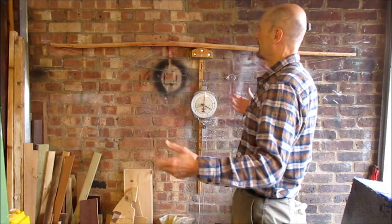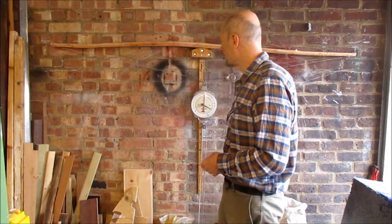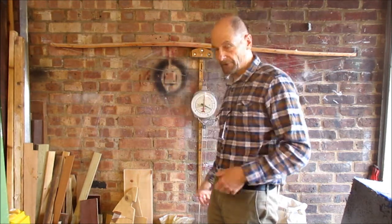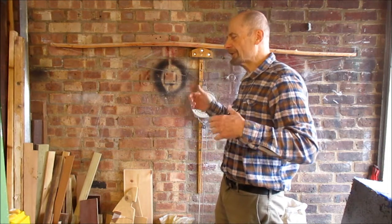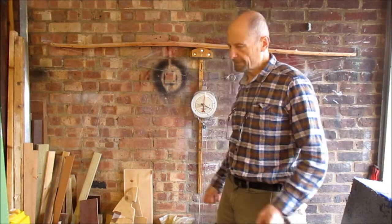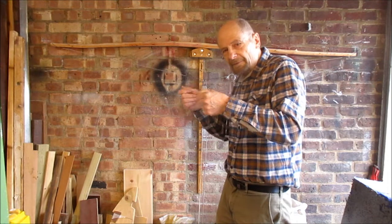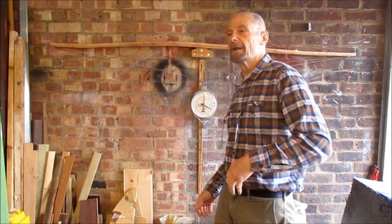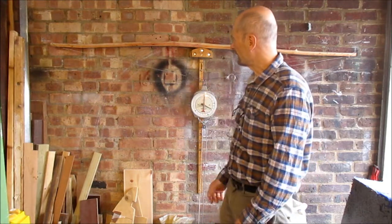So yeah, it's a heavy bow at the moment. I've got quite a lot of wood to take off. Some of those bits I was worried about will end up disappearing as I remove wood. And I now have an idea how much I can dig in with the draw knife on the shave horse. There's no point fiddling, doing little scrapes here and there and fettling. We're not at that stage yet. It's got to come down substantially yet.